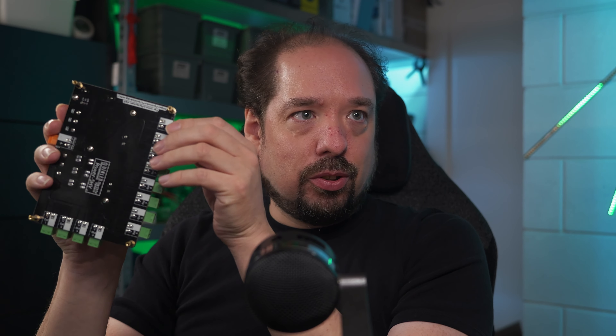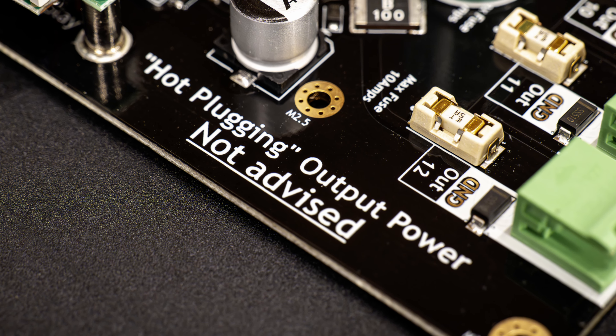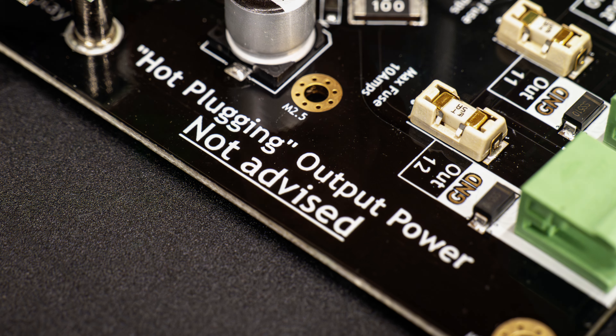A reminder — although the Power 5 has pluggable terminals so you can take the connector off, wire it in, and plug it back in, it is not advised to hot plug output power connectors. Hot plugging means the board is powered on and you insert an output plug with a device that immediately draws power. At 5 volt or maybe even 12 volt that often doesn't create too big of an issue, but with 48 volt and potentially large capacitors on the other side, this can create a noticeable pop. During testing, about 2 out of 50 times I tried it, it blew up the data channel of the Dig Octa brain board that string of LEDs was connected to. It's just good practice to not hot plug power devices that aren't designed to do so.